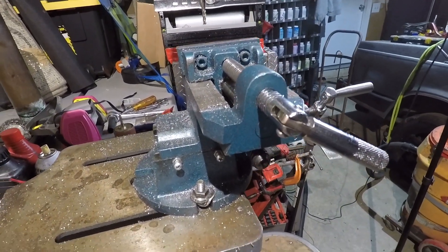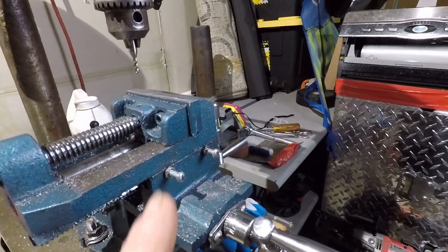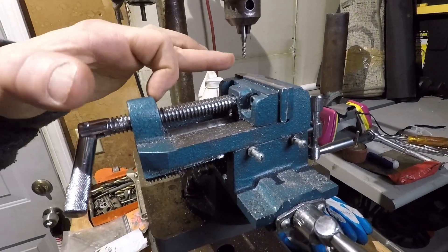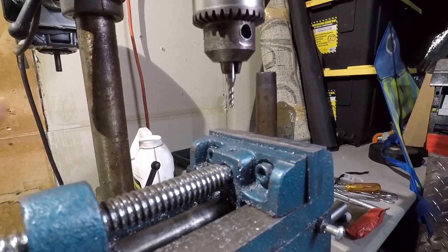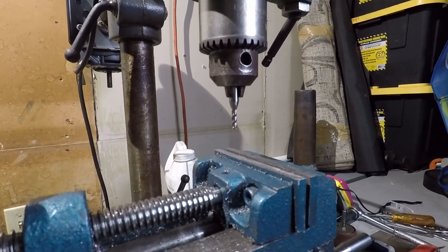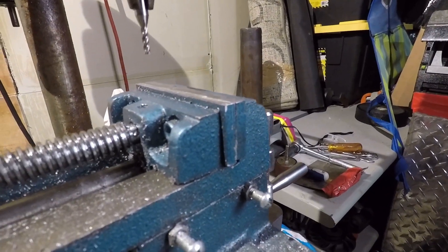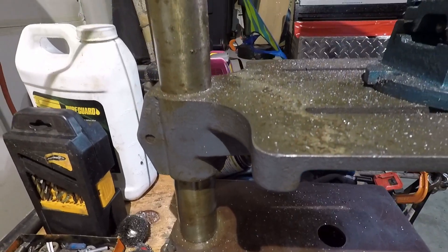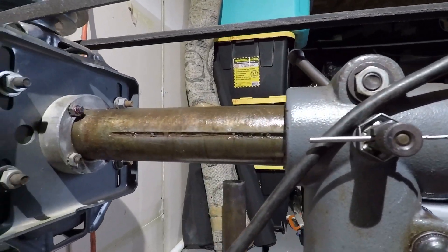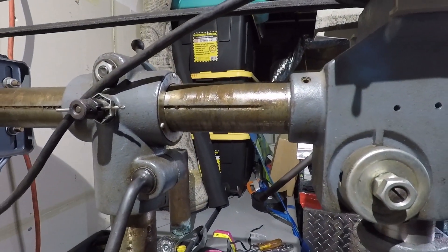I've had nothing I needed to do to the vise either. I just tightened up the slides via the adjustment points on both axes. To kind of test the mill out when I first got this going, I went ahead and faced the jaws off so I could get a nice square surface between both the jaws of the vise and the bottom of the end mill. We've effectively squared up the best I can between the bottom of the end mill and the top of the jaws. The slides do have a little rust on them, but they've also got a good coating of axle bearing grease — probably not optimal, but it does make them slide fairly easily without having to get ham-fisted with it.